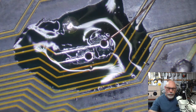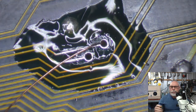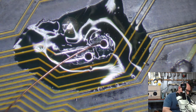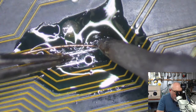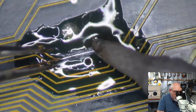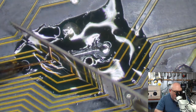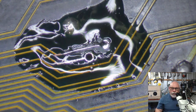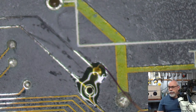Okay, so this is the fun stuff, the trace repair stuff. There is a certain limit that I generally put on trace repairs, and there are different computers that cope better with trace repairs than others, and I think it's usually just to do with the way the boards are made. What I will say is the 840 AV board is a nightmare. If you have trace damage on those, it's bad, because often there is trace damage that you can't see because they've got such tiny, weeny little traces on them. The old Mac II, every single one that I've worked on has had this sort of damage. Actually, bar one, I had one that was in pristine condition. I don't know, it must have been stored in a vacuum or something. But every Mac II bar one that I've worked on has had this same sort of problem and has been a fix. Now, I don't want to curse myself, but you know.